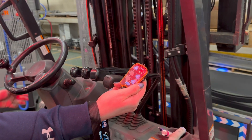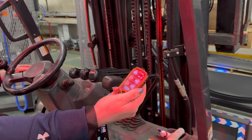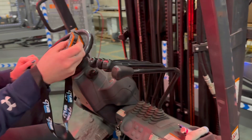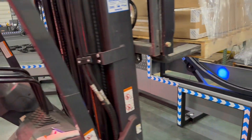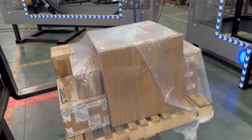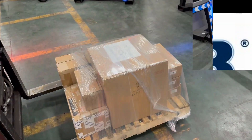This will cause the dispensing unit to index itself to its home location while simultaneously extending out the autocut arm. Once the fully wrapped pallet has been cut free, the forklift operator is free to drive away and come back with their next pallet ready to be wrapped.